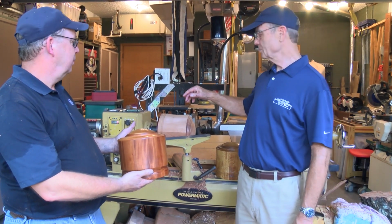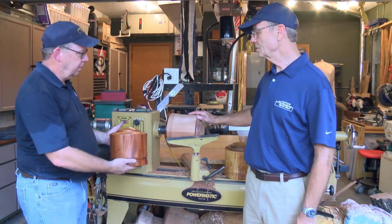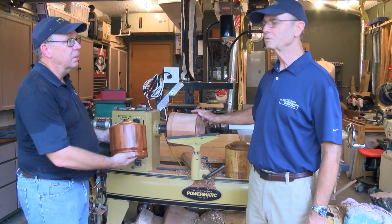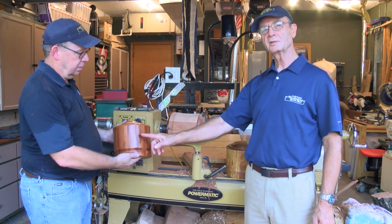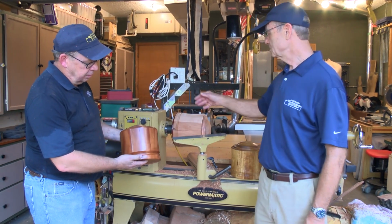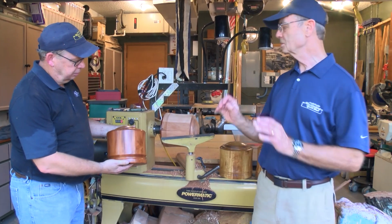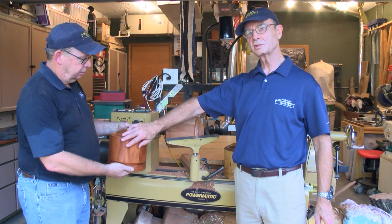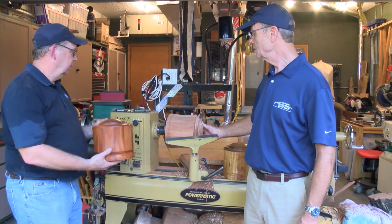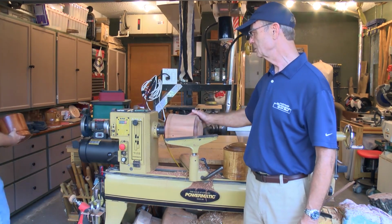Now, just take a look, for instance, at the one that's mounted on the lathe, the same material. Once you touch this with the actual varnish, it pops and shows all the grain, and then once, of course, you smooth the finish. But it's just amazing the difference once you just touch it. Now, all that finish, you can see polishing and so forth, takes place while the lathe is spinning, including the wax finish that brings that shine up.